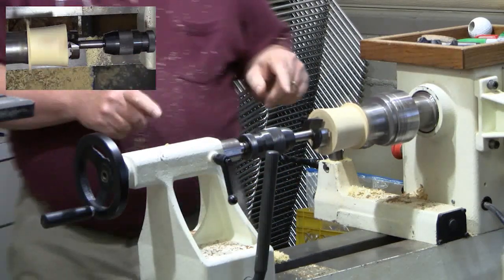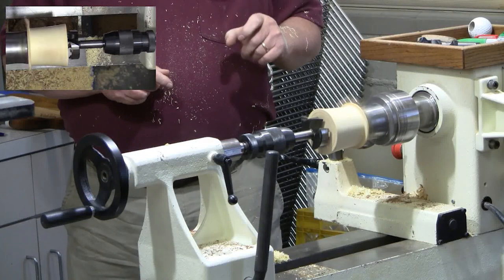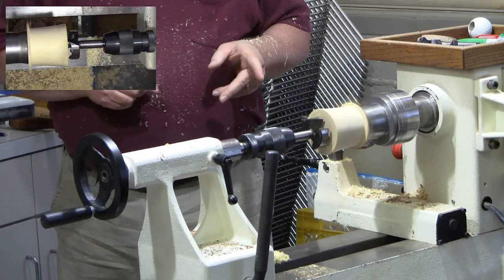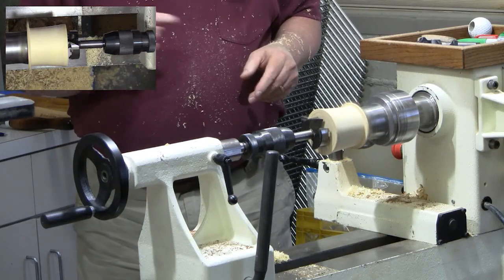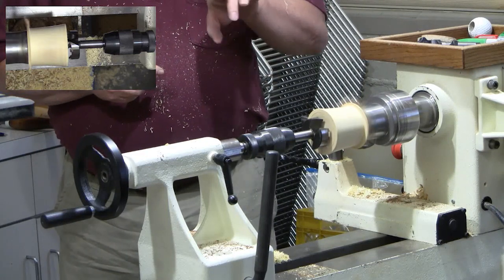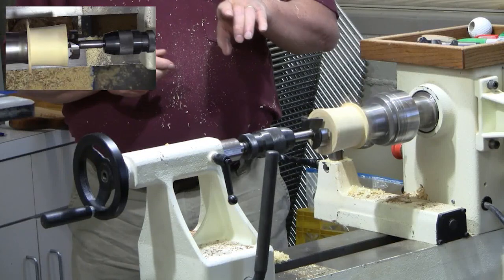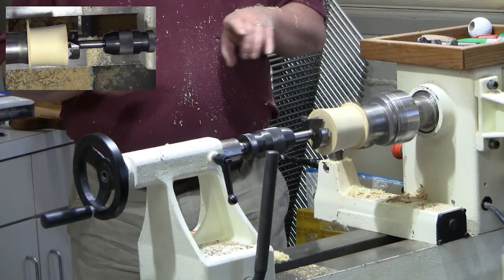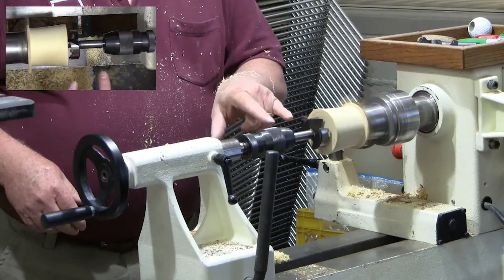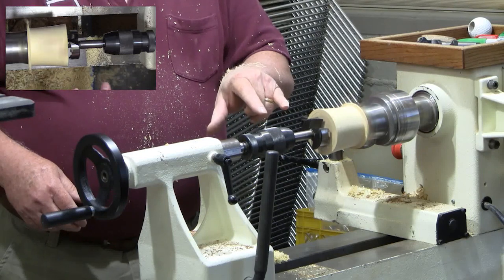The block I started with was three inches. I put about a quarter-inch dovetail on the end, then about an eighth of an inch, so I go in approximately two inches. That way I still have enough wood to hold on the chuck when I go to cut it, and it's not too thin. And I happen to know that the length of that Forstner bit is two inches.